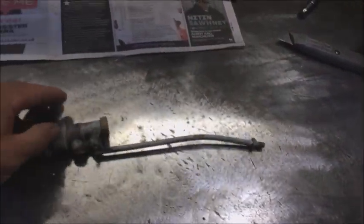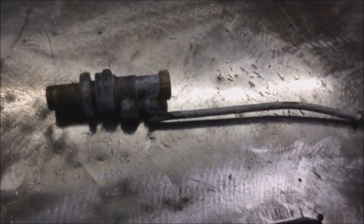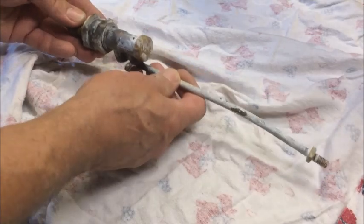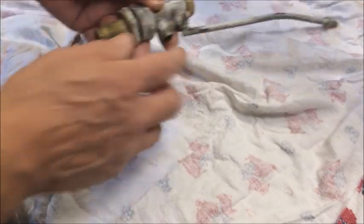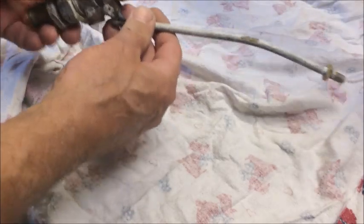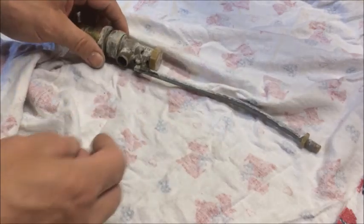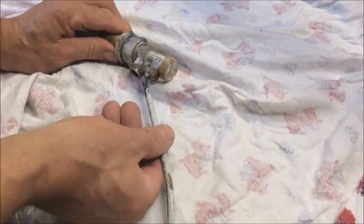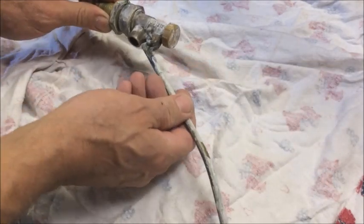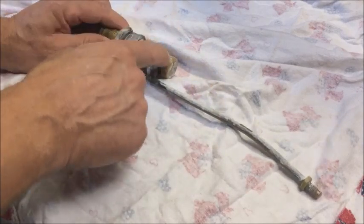All the tools put away now. I thought we'd have a look at this old ball valve — float valve. For those of you who are a little unfamiliar with what they do: it sits in a big tank, water goes in that way, comes out that way. That arm has a big ball on the end which floats in the water. As it moves up, it swivels on this pivot point. There's a washer inside which closes and seals off the water coming in.